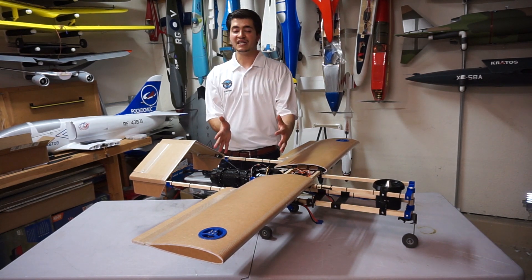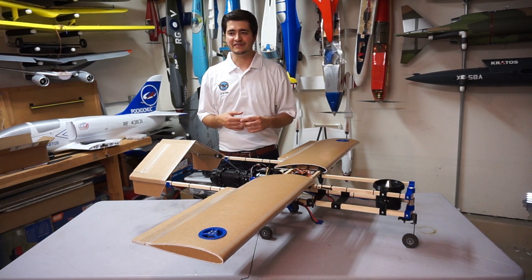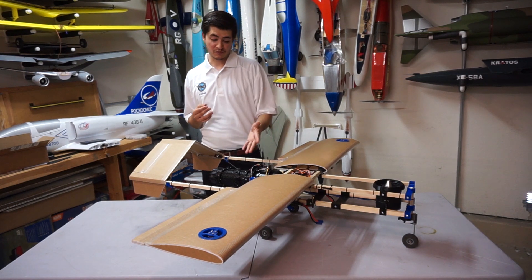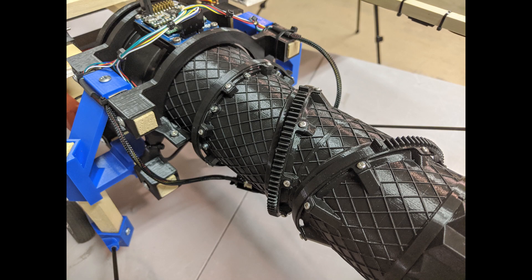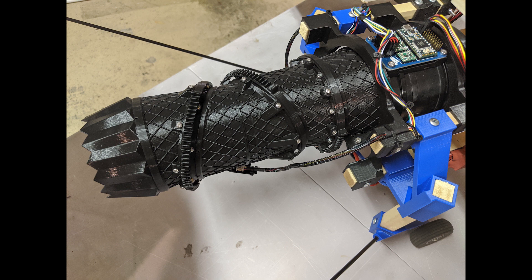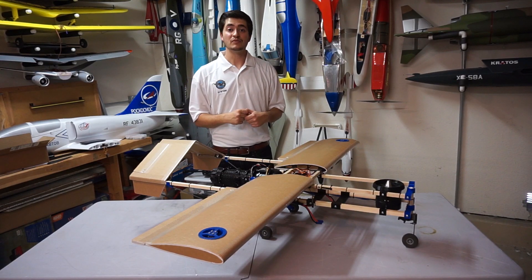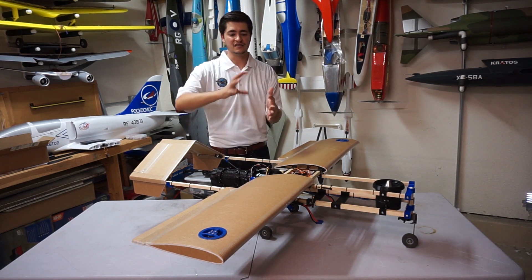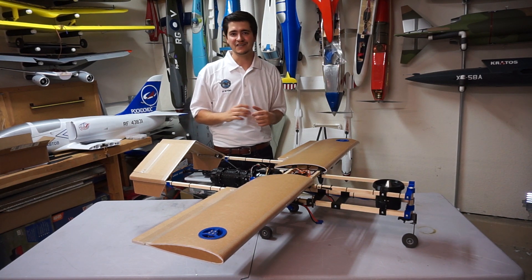Most of those improvements are in the new 3BSM. You may remember that the previous one wasn't damaged in the crash, but I had some changes in mind and I wanted to get those worked in, so this one's brand new. The first change you can see is that the ring gears now have teeth only along the range they needed instead of the full perimeter. This saves a little bit of weight, saves some print time, and overall just reduces unnecessary waste. You'll also notice that the ring gears have some integrated stops that interface with the pinion gears on the motors on either extreme of the rotation. These are for an automatic calibration routine I'm working on that will learn the precise encoder values for each end of the range of motion so that we can get really accurate control of the angles.